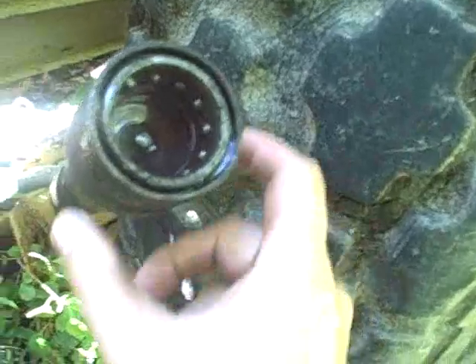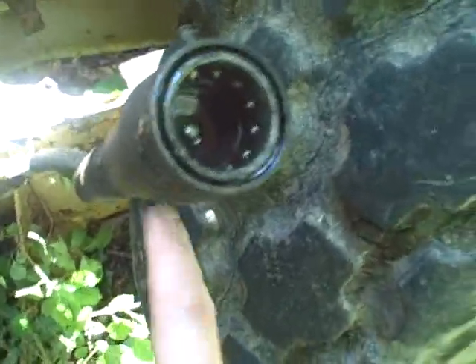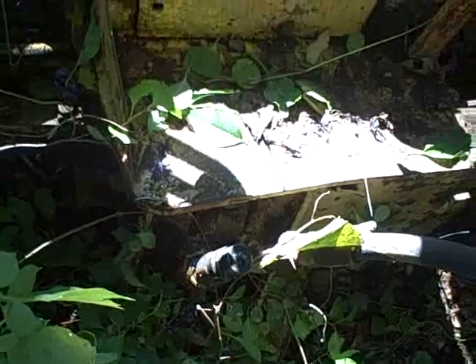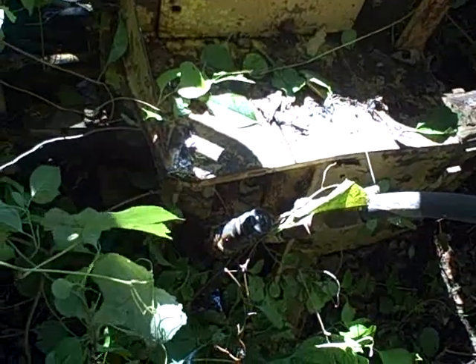This quick coupling works, so I disconnected it just to make it easier - I don't need to take it off. You can see there's a check valve here that actually closes when you disconnect it. That stops the flow of hydraulic fluid, unless you push it with your finger like I just did. Now I've got to make sure I know which side is going to be my supply and my return.